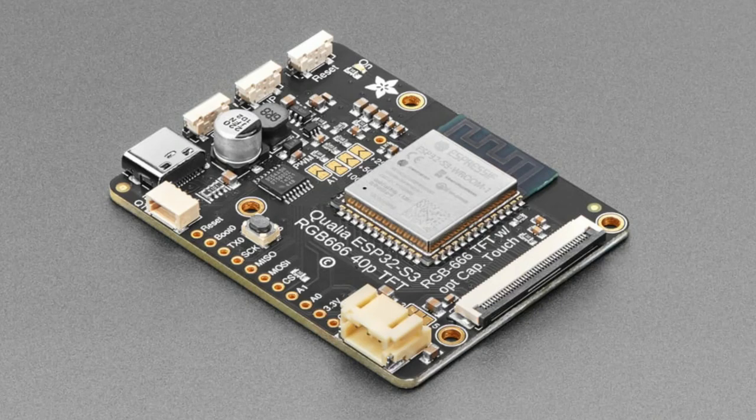One thing to watch out for is these displays are a little bit more complicated than most. You need to SPI initialize them, and so we have initialization code. After you've done SPI initializing them, then you can blast out pixels. And you have to blast the pixels out repeatedly, so they use a lot of PSRAM and a lot of the CPU capabilities. If you can't get to the PSRAM while it's trying to display through the cache to the display, you're not going to get good results. It's using a lot of the capabilities of the S3. You can do basic animations, basic videos, graphics, of course, in Arduino. And then in CircuitPython, graphics, REPL, and more.